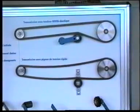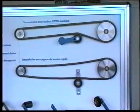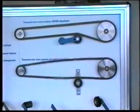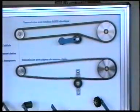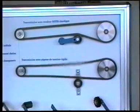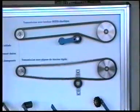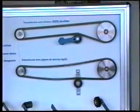The direct comparison of a chain drive with and without an automatic ROSTA device shows clearly the difference between a smooth running and a whiplash-like hammering when using a rigid system. Rigid systems favor the high wear of all transmission components.